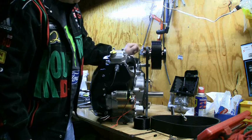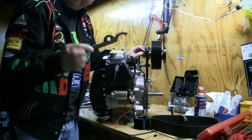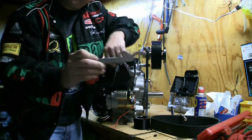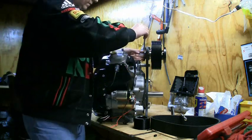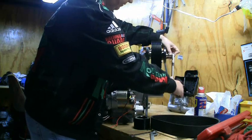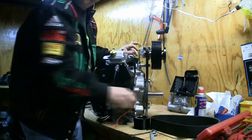Take your laser cut wrench — this is a special wrench, but if you lose it or don't have one, a military-style spanner wrench or spanner plug wrench works perfectly. Most of the stuff on the internet has a swivel on the end so that it fits multiple sizes of cannon plugs. We're going to loosely just snug it a little bit, but not so tight that we can't move it. The reason you want it snug is so that you can tighten your belt down and not have it shifting around on you.